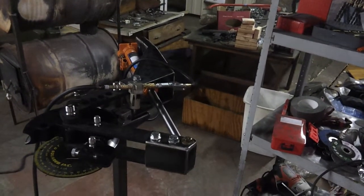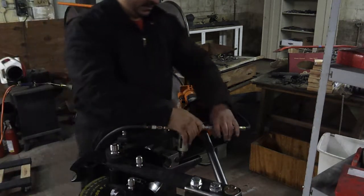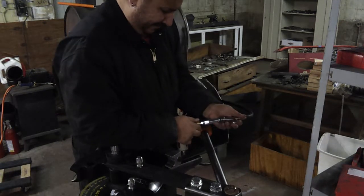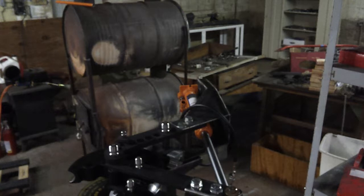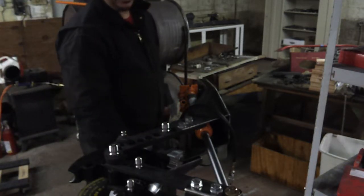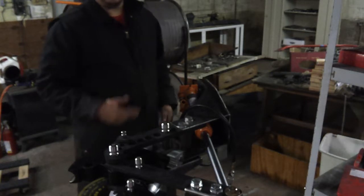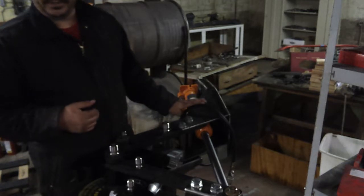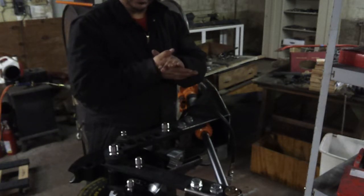If it makes you feel any better, I did drop about $50 on bolts and stuff in there. So let's retract this and wrap up this video. I'm just going to disconnect my air supply. By the way, this is really hard to remove when it's under pressure. I'm going to mount one of those filters to the base here so it's always connected. I'm trying to run those filters right before any piece of equipment I'm using — like heavier equipment like this and my plasma cutter — to try to keep the air as clean and moisture-free as possible.